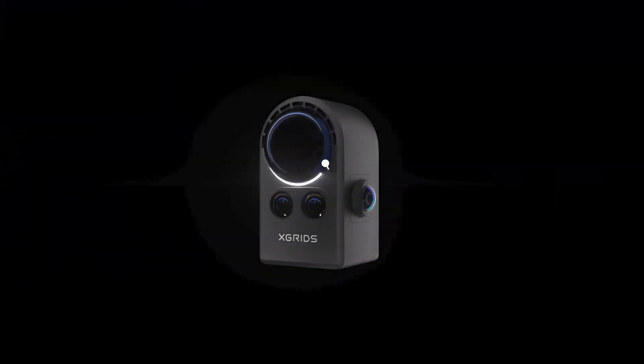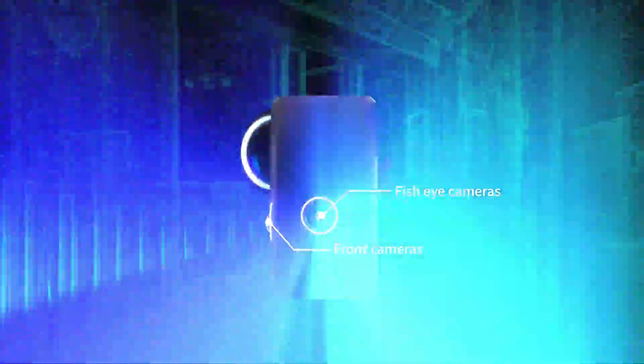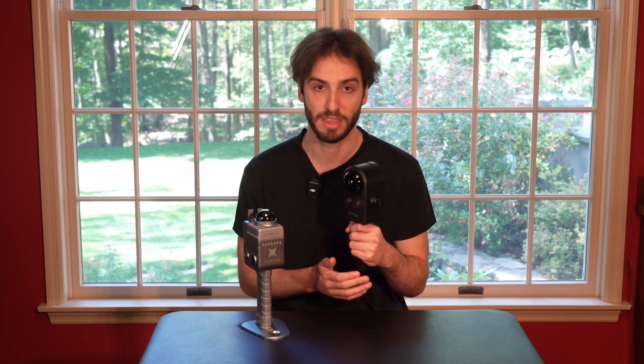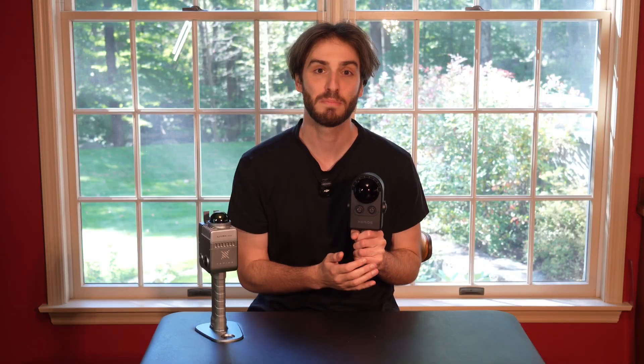Let's take a look at some of the features of the PortalCam. There are four cameras total — two front-facing cameras, one shooting at 85 degrees and the second at 100 degrees. There are also dual fisheyes on both sides shooting at 200 degrees each. Finally, there's a giant LiDAR unit on top that passively shoots roughly 860,000 points per second. The PortalCam has a half-inch CMOS rolling shutter sensor.